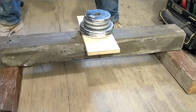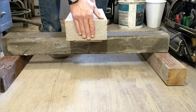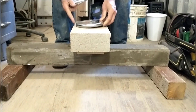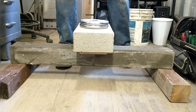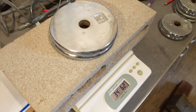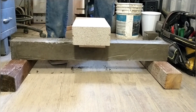I'm using about a five and a half inch wide board to set the weights on, centered between the span. When we were perfecting our method for making these aircrete samples we captured a couple of imperfect mixes, and those came in handy for calibrating how much weight these bars could take — I had no idea how much it might take to break them. Those test bricks from failed batches helped us get a good starting point so we wouldn't start with too much weight.